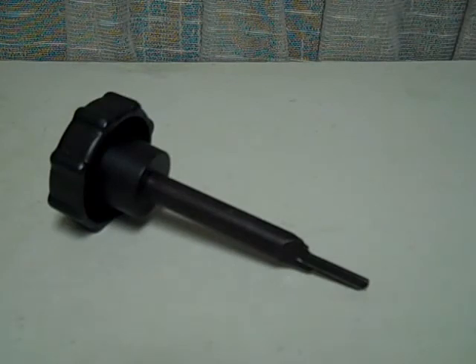Here's another little tool I like very well. This is from Major Manufacturing and it's called their torque tool for Kwikset Smart Keys. When you don't have a key and can't get the cylinder out, you can use this tool to break the sidebar and open the lock — just stick it in, turn it, and you've got it open. There are two versions of this, so check with your local supplier to find out which one you need. You'll probably need both of them, because the newer version of the lock is coming down the pike for us to service as well.